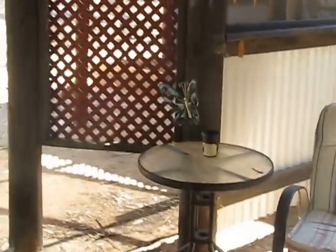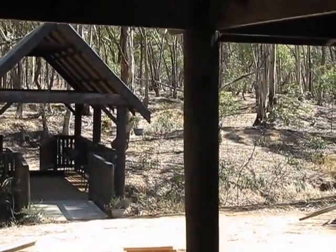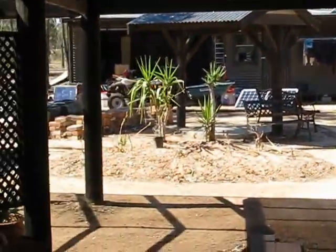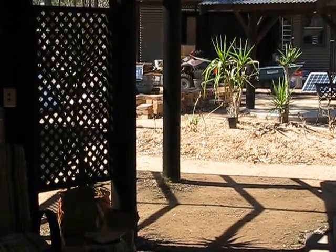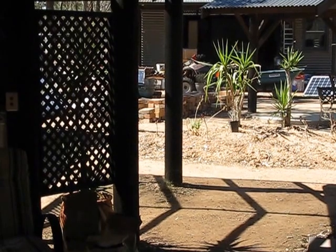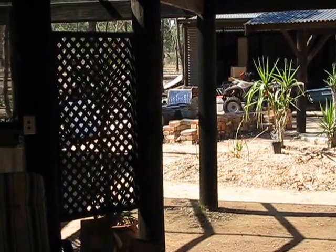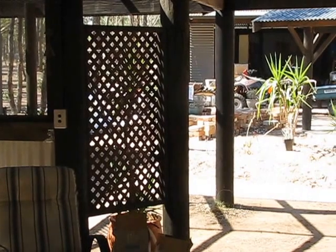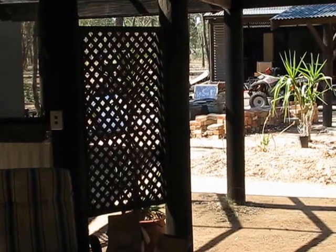What I tend to do is on the base, this outdoor area we've got here, and the bridge is built out of poles. This outdoor area has 16 main poles in it. The 16 poles become the base of the structure. Now I string line it out as you would do a normal building. Square up your string lines, mark your holes, and then it comes to the tragic bit where you put the poles in the ground and one pole's 4 inches, one pole's 5 inches, one pole's 8 inches. Well, when you run your string line through, you might have got your holes dead straight, but obviously your poles are not going to cooperate, let's say.